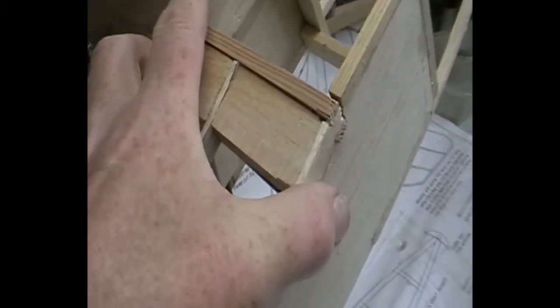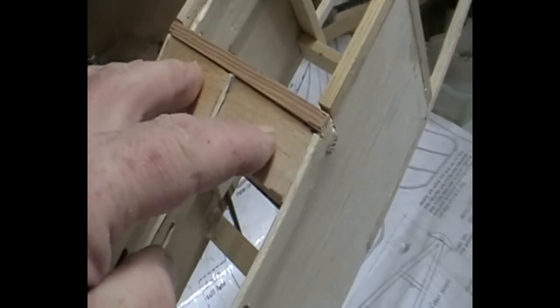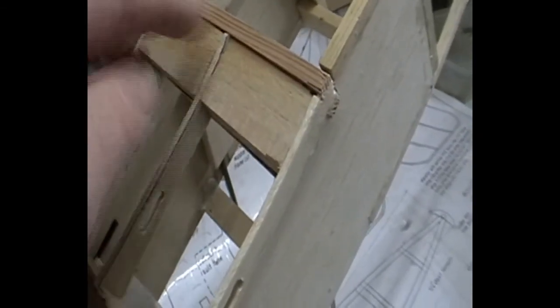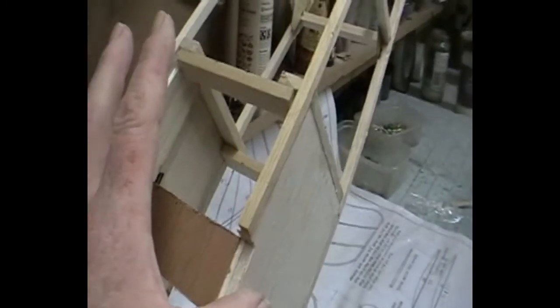Okay, there's two ways you can do this. Normally, in the situation we've got now, I'd clamp the sides to hold the base plate that's going to hold the nuts on, the wing bolt nuts. You can either clamp so it holds it in place, then you could just drill straight through. Or you can always just mark. Sometimes, depending on what type of aircraft you're making, you won't have the option to clamp the sides here where my finger and thumb is.